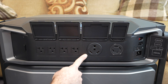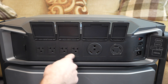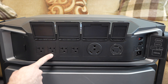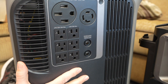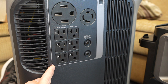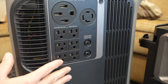For native AC outputs, the DPU has a 30-amp 120-volt RV-style port and four 120-volt 20-amp outlets. With an AC source connected, the inner outlets have a zero millisecond UPS switchover time and the others 20 milliseconds. The F3800 has six 120-volt outlets, with three on the side rated for a 20-millisecond UPS switchover. Both have been tested and the UPS feature works on each unit.